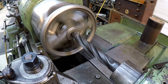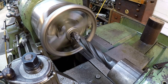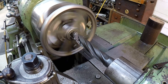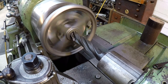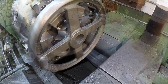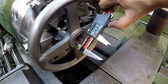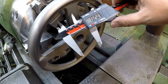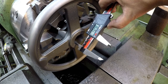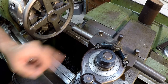Our core drill did a pretty good job drilling that hole with no fuss, no chatter. Just seeing where we ended up — a little bit over one and five-sixteenths, so that was about 10 to 13 thousandths oversize. Now we'll get a boring bar set up and bore it to size. I'm going to be using a one-inch boring bar — one of my good high-quality bars, very hard and rigid.